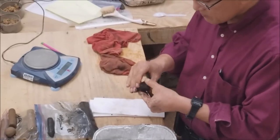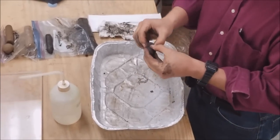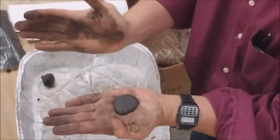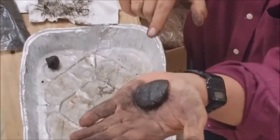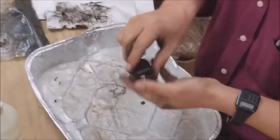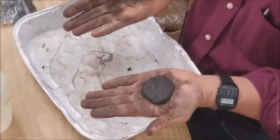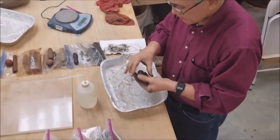It's just a little bit past moist. So we make a small pad. There's no moisture on the surface and I'm going to strike my hand, and when I strike it you can see this surface right here — it's called a livery surface. You can see a slight sheen because we got water on it. I'm going to do it again and mix in the rest of the sample so it can stay more secure in my hand. You can see right there no moisture. I strike it on the side and we can see water came out, and that looks like a liver so we call it a livery surface or livery appearance. When I remold it again we lose the moisture.